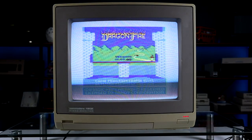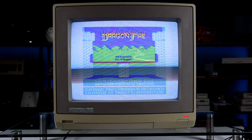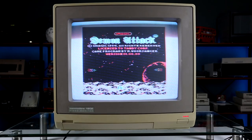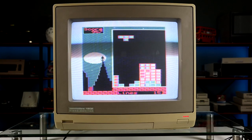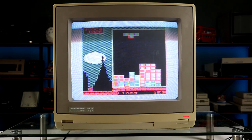To me, the default green color scheme is a bit jarring, and the Motorola 6847 video chip offers average resolution for the day and a limited color palette. It can display bitmap graphics modes with up to 4 simultaneous colors, but lacks hardware sprites. The omission of composite or luma/chroma output means the video quality isn't great on a high-end monitor, but it was designed to be connected to the living room TV of the era, and probably was fine for that.